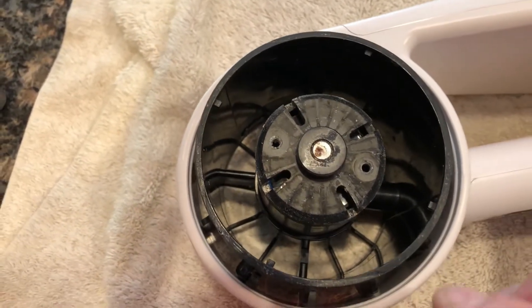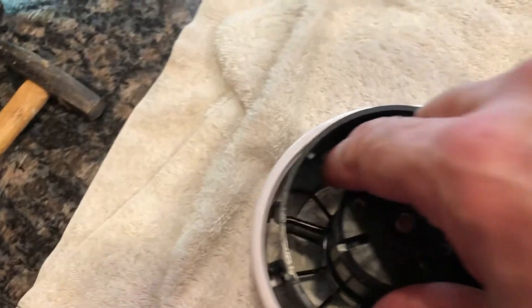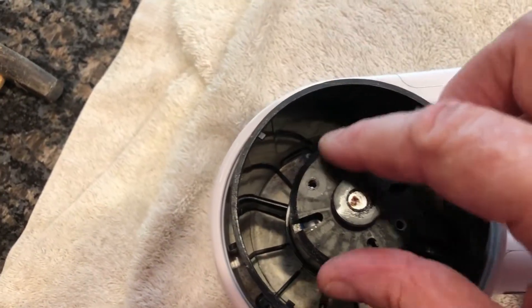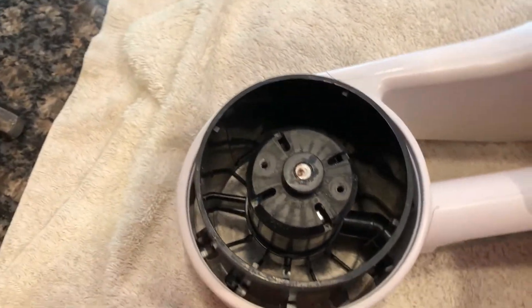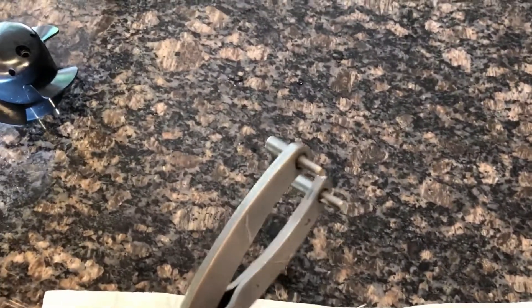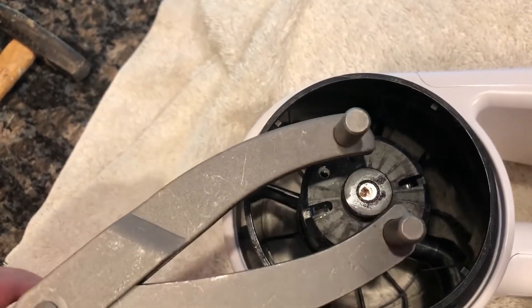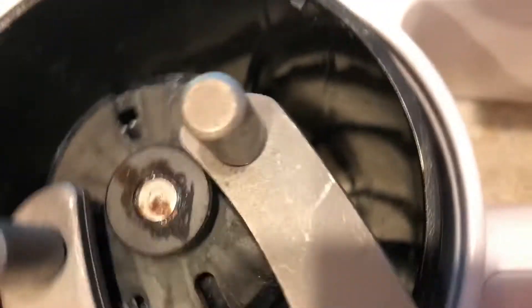What you can see is the end of the motor. This whole end tube revolves — it's not just a thin head, there's a head up here about maybe half an inch thick, and this whole tube will revolve when it's not seized. What I've done is make myself a spanner wrench tool. I had to grind down the ends so that they'll fit in those slots right there, and once they go in, you can get a tremendous amount of torque on it and turn that motor.